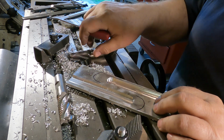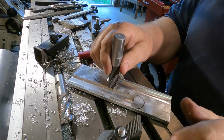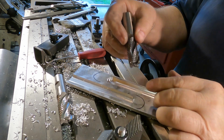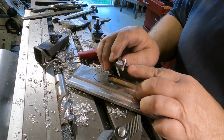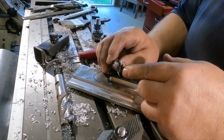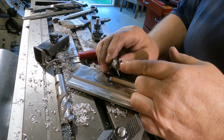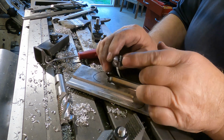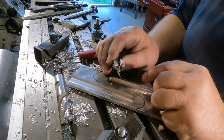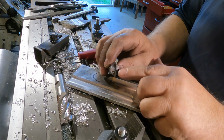So that meant the only thing left that it could be was that this cutting tool was being forced up into the collet. Why would that be? Well, I looked at the end of this, and my conclusion was these are supposed to have a negative, and I'm not sure what a real machinist would call these angles, but the cutting angle needs to angle towards the center of the end mill rather than the other way. This has a little bit of a point on it, and it should have a convex surface over here. I didn't know that for sure, but that's the conclusion I came to just guessing.